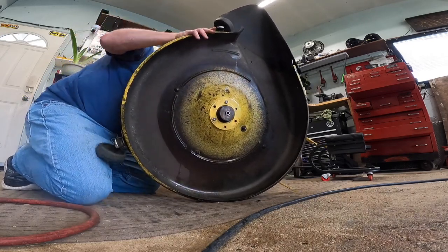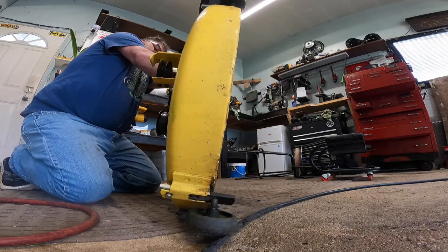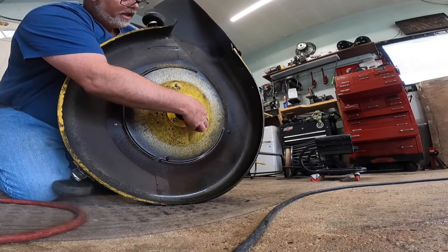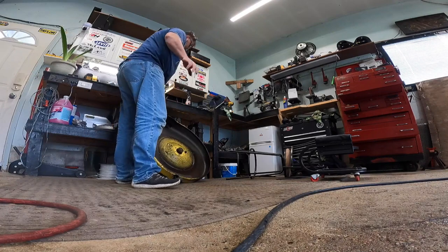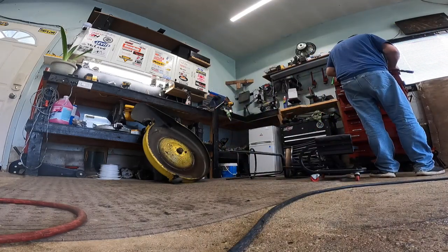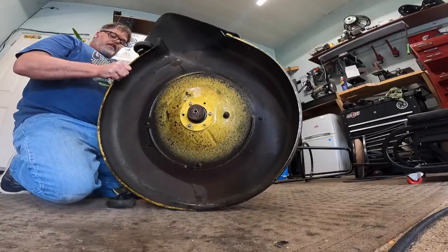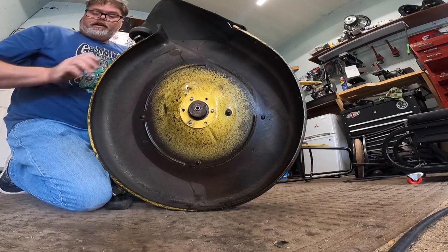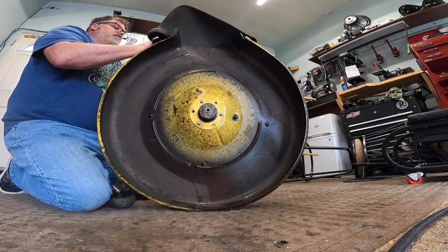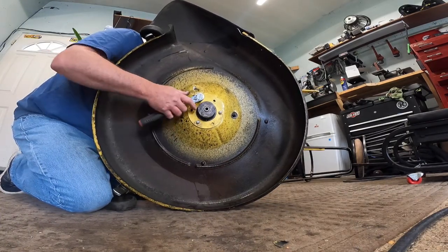That ring there is kind of working like a big washer - leave a comment down below if you agree. Don't forget to subscribe, like, and hit the notification bell because this is some pretty technical stuff. We got her - hopefully she doesn't fall back out. Now we'll just leave it up here and get the right size wrenches. Half inch - or 13 mil is the same thing. Slot the 13 mil on the head of that bolt, slot the ratchet on and shake her in. Three bolts in. Don't want to give it too much - I've been known to break these studs off.